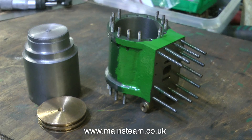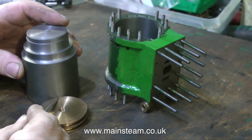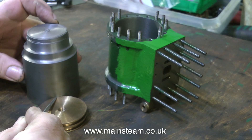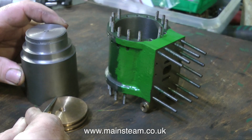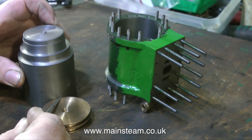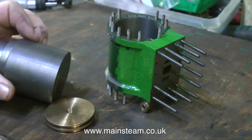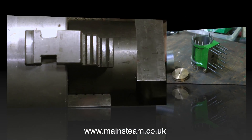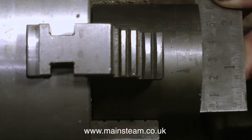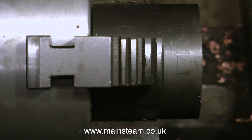What I'm doing at the moment is selecting a piece of metal to make the piston from. This is some very close grain cast iron obtained from the usual place I get all my metal from, and I'm using the old piston to very crudely mark out the thickness. It's not a precision piece — when I start to machine it I will machine much deeper than this and then finally finish it using a micrometer.